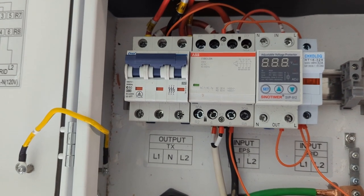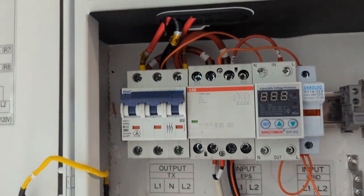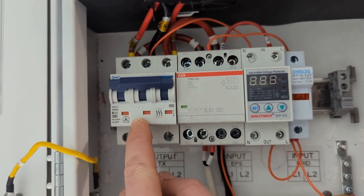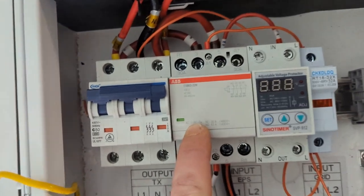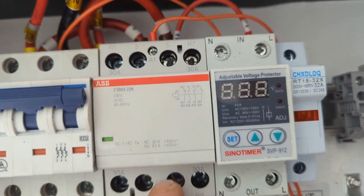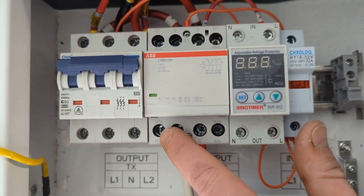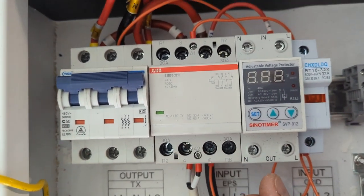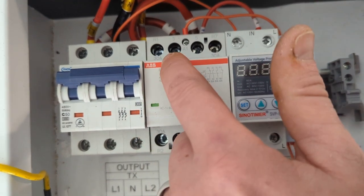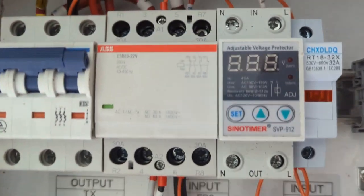For the most part you're going to be able to use the defaults — what the unit ships with. I put a different breaker in here for a couple of reasons. This is the default ABB contactor, rated for 63 amps, but only on the two center poles. One quick note about these ABB contactors: only the two center poles are switched on and off. The outer connections here are always on — they are a pass-through — and it says so right on the diagram on the front of it.